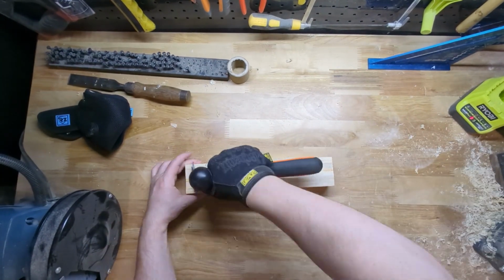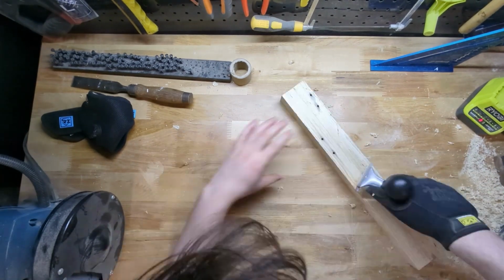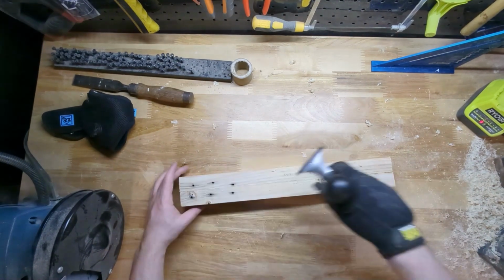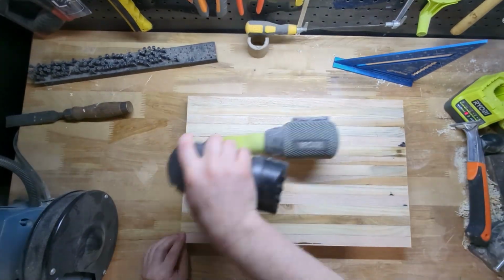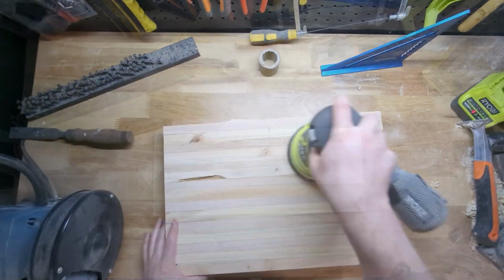So now I'm just cleaning up our leg pieces and giving everything a bit of a sand at this point. I've also decided to put a 45-degree chamfer along the top side of our slabs and a small roundover on the underside with my palm router. Hopefully this makes it look just a bit more professional. Then all that's left to do is cut the legs down to their final dimensions, do some super basic joinery, and decide how we finish this.